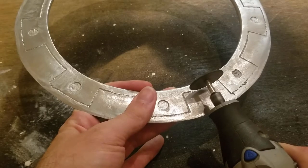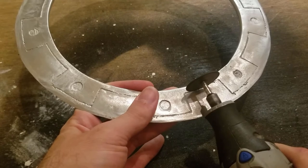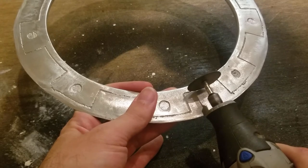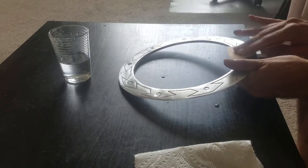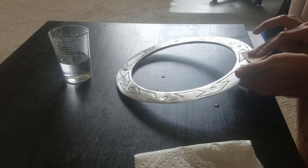After removing the inlet sprue, I used an angle grinder to rough out the edge of the blade and remove the major surface imperfections left by the casting process. I then used a Dremel to clean up the groove patterns. Both faces were then sanded until smooth and shiny.